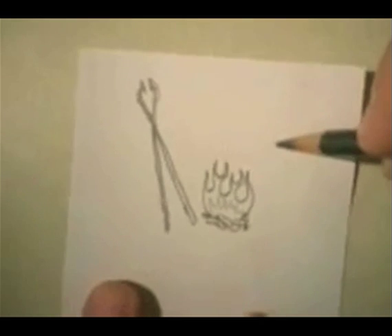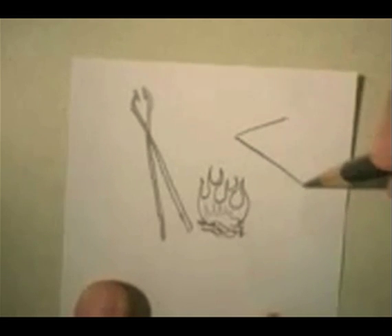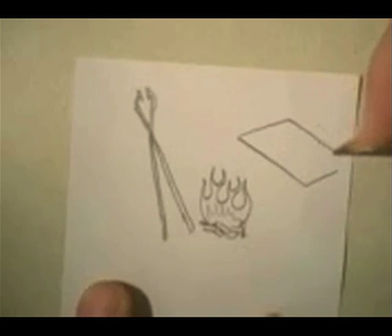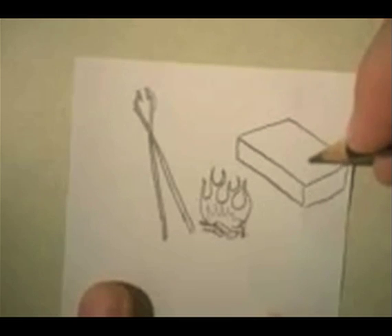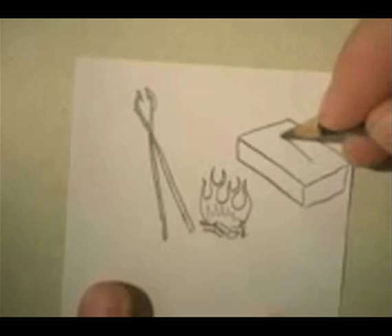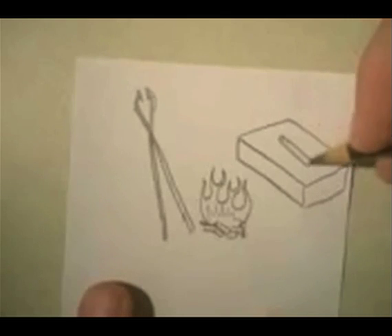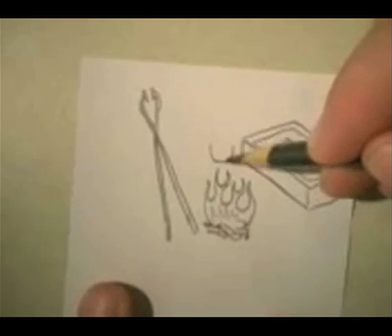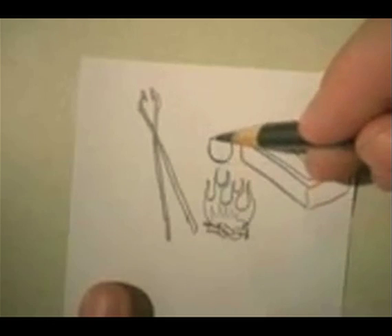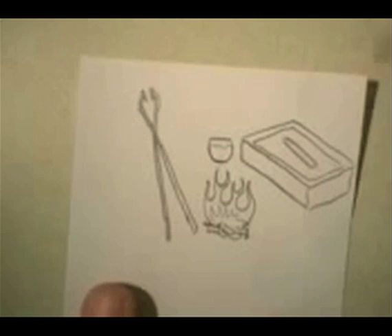They also used molds — a kind called a sand mold. Think about making a sand castle. If you have sand in a box and it's moist, wet sand, and when you push on it, it makes a shape. So if you were pouring a piece of molten metal into a shape that you pushed into the sand, when you pulled it out, it would be the shape that the sand was holding. Then you could file that down and make it smooth. So sand molding was a big part of the job. You would heat up a crucible over the fire with metal in there that would get so hot it would become liquid, pour that into the sand mold, and pull it out — and you would have something made of metal.